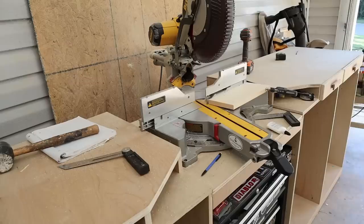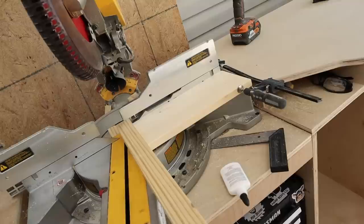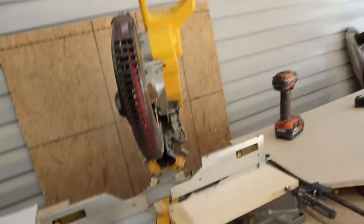All right, I said turn to the right, I meant turn to the left. And so if you've got your block on here, this is square. I made sure that my stop block is exactly square. And I just set it up to where I would cut 2 inches off the top. And so I line it up square, and I just hold it. It's up against that fence. It's up against this block. I cut, then I rotate it once to the left. Make sure everything's nice and square, and then cut again. And then that gives me my two-sided taper, like this.